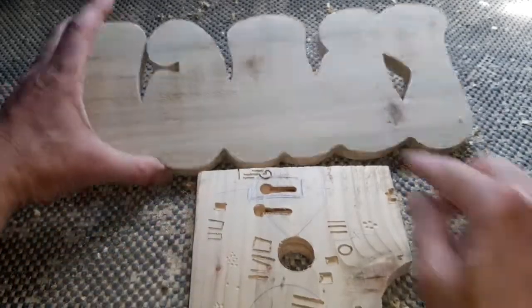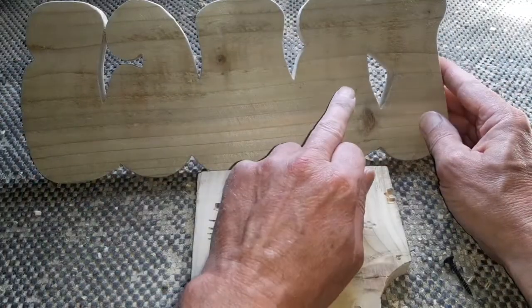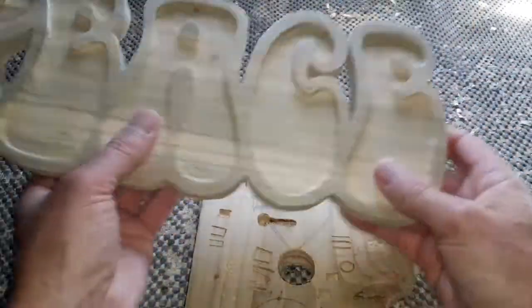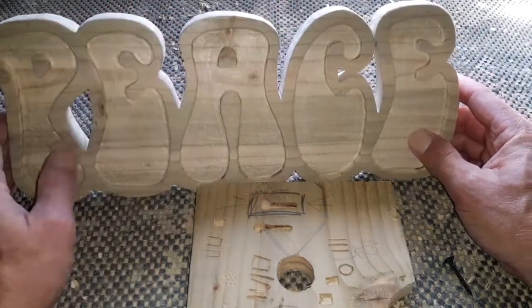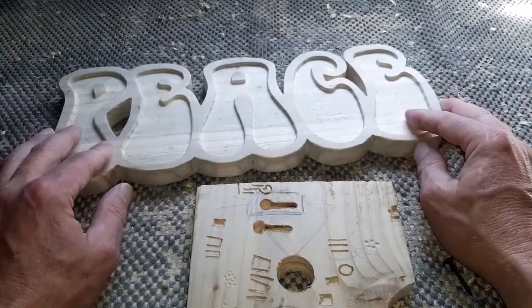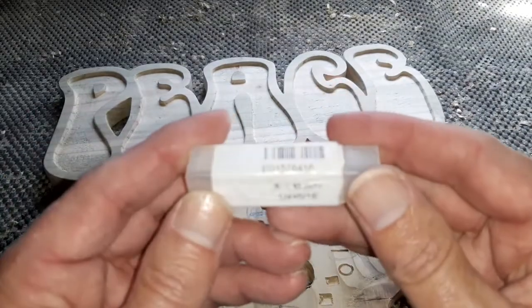So we'll mark off the center of this, just one little line down there. Bigger projects, I have put two slits on, maybe one there and one across here. It's entirely up to you. Like I say, you could put pin nails straight into the fence and hook it on. Nice bit of chain on top or whatever. You could have left it on the wood completely and done a different project. But anyway, we'll quickly put a slit in the back here with the 5/16 T-slot bit.